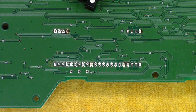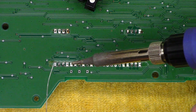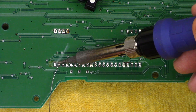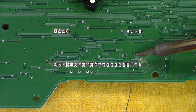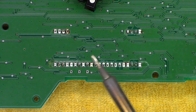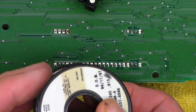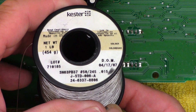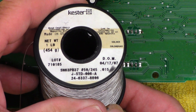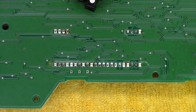Judging by just looking at these connectors, these two on the end right here have rings all the way around them — so that could be the possible issue. Maybe it wasn't that FET or transistor after all. I am using the Louis Rossmann 15-thousandth diameter solder. It is the Kester 0.015 inches — 15-thousandth solder — and it is a 63/37 mix. Very good solder for very delicate, minute, intricate work.